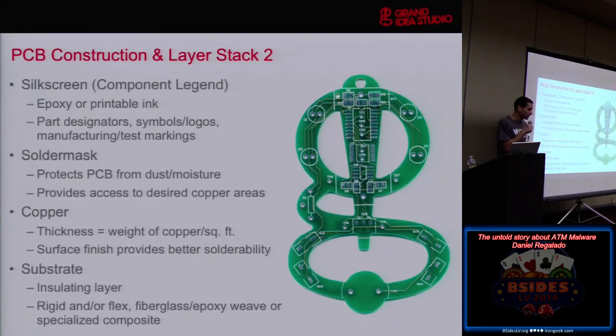After that, you have your layers of copper and substrate. Different thicknesses of copper depending mostly on the current carrying capacity needed on those traces. Different surface finishes — sometimes boards have gold pads, sometimes silver, sometimes lumpy if solder has been applied — just to aid in solderability. The substrate is normally fiberglass epoxy weave, but depending on the application it could be some other composite materials, especially for highly integrated mobile phones or RF devices. Some circuit boards can even embed discrete components like resistors and capacitors into the substrate.